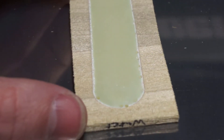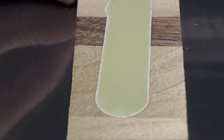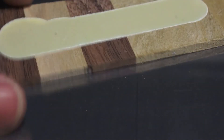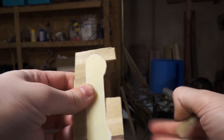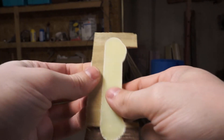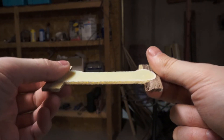Flaming or charring the inside of the channel did not seem to reduce the bubbles at all — and I'll get into why that's probably my fault later. Next is the water-based polyacrylic: there seems to be some improvement, fewer and smaller bubbles, but the bubbles are still there, so the weak point remains. Last is the oil-based polyurethane — again an improvement, smaller bubbles and a thinner bubble layer, but it's still going to act as a weak point. I tried to break it, and I could break that bubbly urethane bond just with my hands. An adult rider putting pressure on the edge exerts far more force than that.